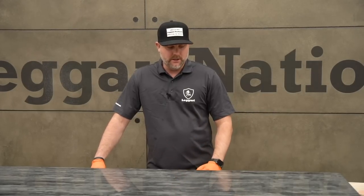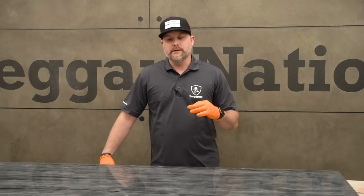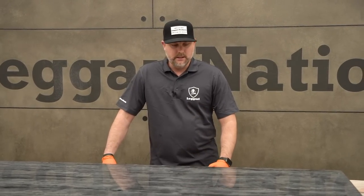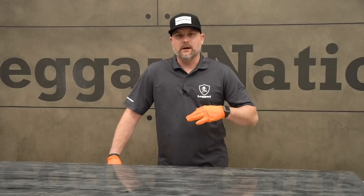We'll do a final mist coat, check our edges, scrape our drips, and then we'll let this board set up, and then we'll go on to the next step tomorrow, which is putting the flag stencil down and then ghosting a color of spray paint over that. But this is kind of the process, and we'll use the other 3 quarts out of the 1.5 gallon kit after the flag's done to flood coat the whole thing to lock everything in.